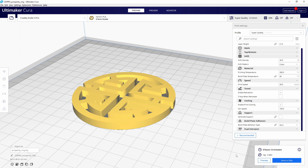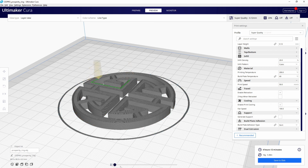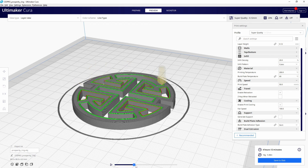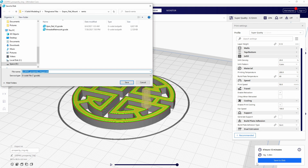We can even analyze the toolpath. This is particularly useful in the event that something peculiar occurs during the print and you want to go back and study the motion of the nozzle in that segment of the path. Now, depending on your setup, we can print directly from the slicer, or save your G-code file and transfer it to your printer with some sort of flash media.